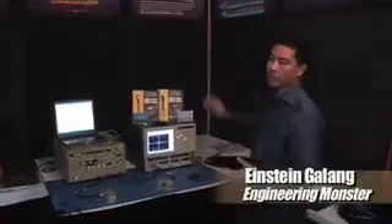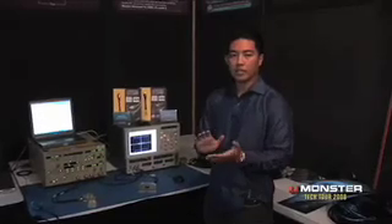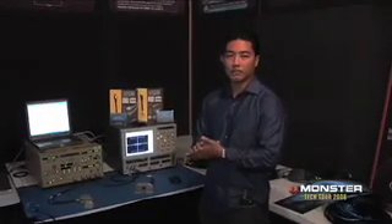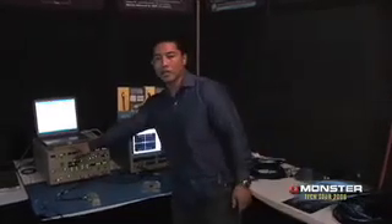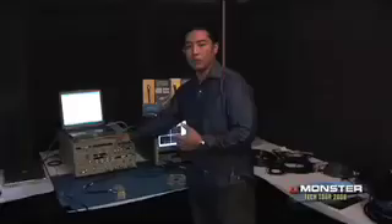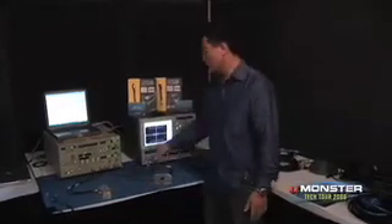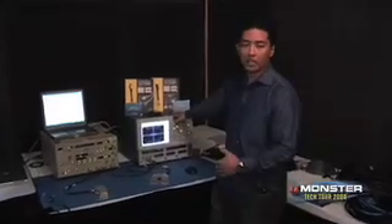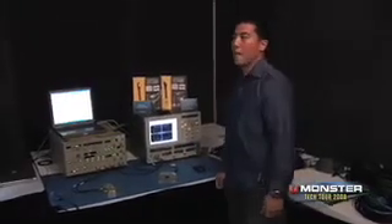Thanks Terry. So standard speed — 720p or 1080i — equates to 2.23 gigabits per second in total. But in HDMI we have three video lanes. So if you divide 2.23 gigabits per second on standard speed HDMI cables, you get 742 megabits per second, which is shown on this Anritsu generator here. The Anritsu generator simulates the exact same bit waveforms that come from your Blu-ray or PS3, go through the HDMI cable, and through this analyzer, which analyzes the integrity of the signal coming from the HDMI cable.